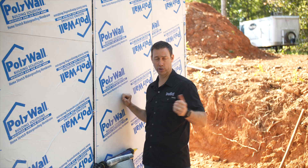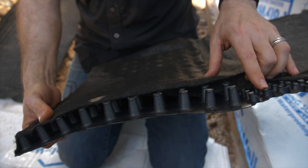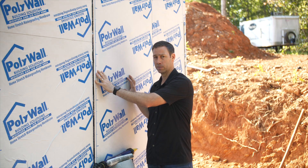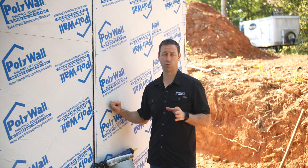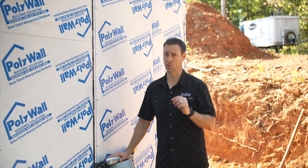One important caution: be aware of UV exposure. This membrane is supposed to be covered within 30 days. You can cover it with their Arroyo product — which we'll get into in the next video, their air-gap drainage and drying product — so stay tuned for that. We want to make sure we're cautious about how long before we backfill and UV exposure; don't leave this exposed for six months. But if you do this process as described, you're talking about a foundation that's going to be waterproof for the life of the building. These details come from their parent company Polyguard, which has been doing below-grade waterproofing for 60-plus years on commercial jobs as deep as 60 feet below grade — so a 10-foot residential foundation is no big deal.